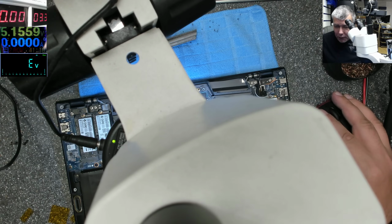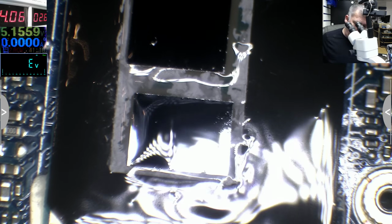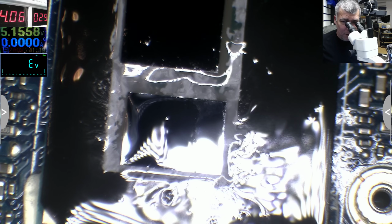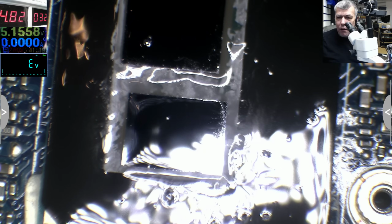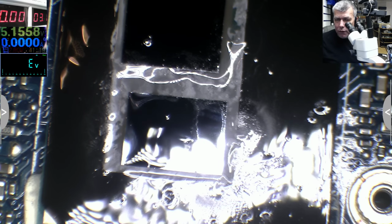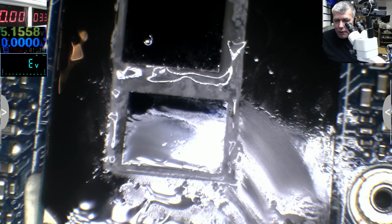Yes, I put some petrol there. It's Zippo petrol. I saw people asking on the last video. So now we'll come with the current 3.3. Check there. You can see it. Oh, on, off, on, off. More current. We are like 5 amps now. On, off, on, off. Actually, it's getting very hot. That's the chipset. This one is the chipset, and it's gone.